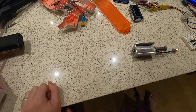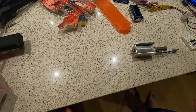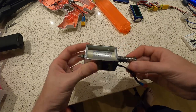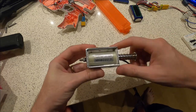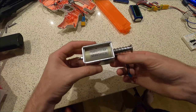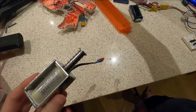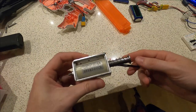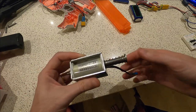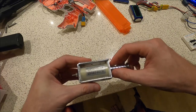Hey guys, this is Airzone. I just thought I'd touch on an interesting subject when it comes to solenoids, full auto, and microcontrollers. Here is a solenoid - this is one of the eBay specials with the spring on the back. When it comes to microcontrollers and driving these things, using an Arduino or anything like that, you drive these with a MOSFET. You connect this into the battery through the MOSFET and run the gate on the MOSFET to push it in and out.